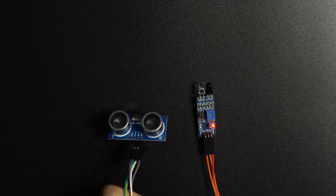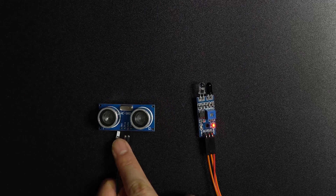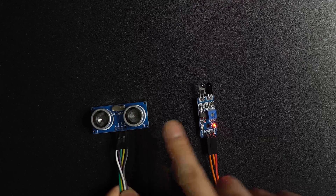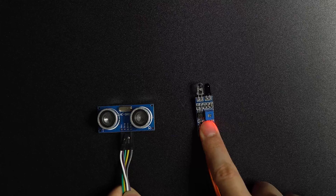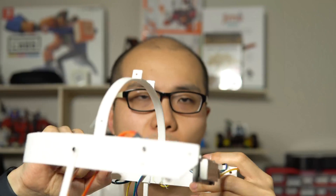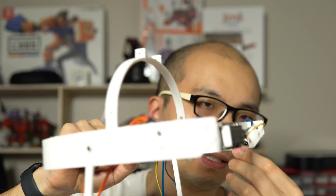We could add more of these sensors to our contraption. Another option is a different sensor such as the ultrasonic HC-SR04. However, it's a little overkill — it can actually tell how far away something is, whereas this one just detects presence. In our application, we really don't need distance information.